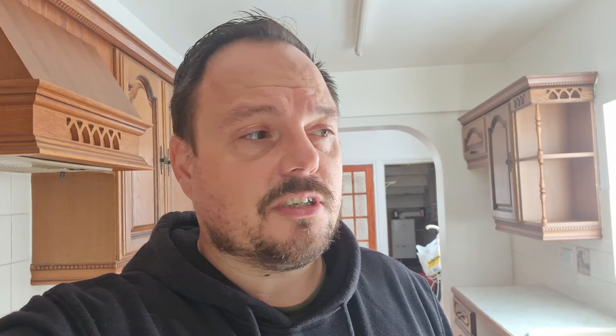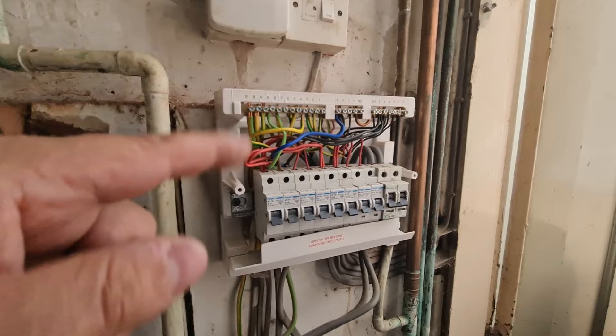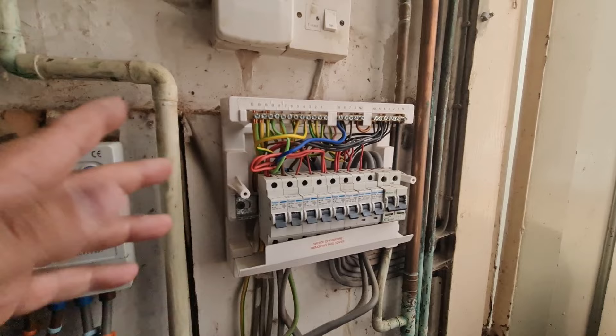Going to play around on this circuit, get the test set with new batteries and see if I can get that value to drop down a little, even take a measurement off the back of one of the sockets to see what's going on - because these are pretty old and scabby. I've got all the terminals back in now and I've just been through and done the IR testing. Surprisingly, it was clear on all of the socket circuits. A little bit low on the lighting circuits, and again that's probably to do with some of the corrosion I showed you earlier.